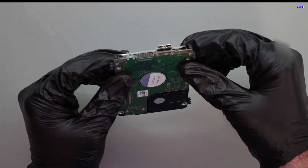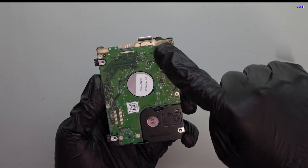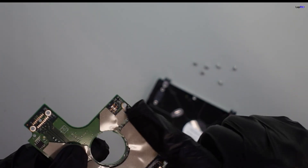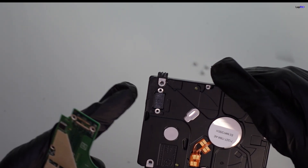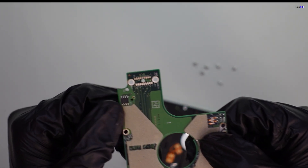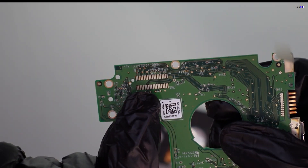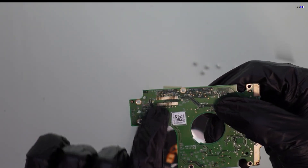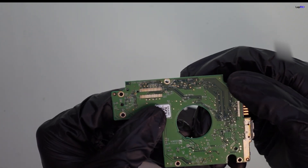As you may know from our other videos talking about Western Digital drives, usually what we need to find is a compatible PCB that is a SATA one, because the USB port isn't going to cut it. With the PCB up, we can see connections that go here to connect to the drive, and contact points that match up when you put the PCB in. A lot of times, especially on older ones, this area can be extremely dirty — a darker color. This one's actually very clean. If you do see dirty contacts, you can use an eraser to very slightly remove anything interfering with the connection, being careful not to scratch it.